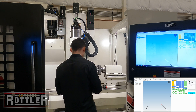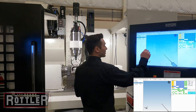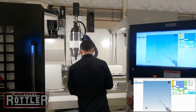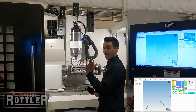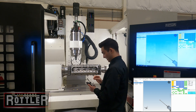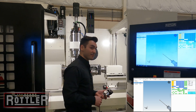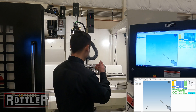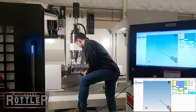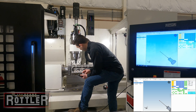Now we want to go and get our middle section, or as we call it, our dividing line. This is a manual operation now, so I need to rotate the A and B axes — A being the fourth axis which the head is sitting on, and B being the fifth axis which is the spindle itself. I can also use the linear commands: X, Y, and Z. Sometimes a mirror is helpful. I'm now just above my first point in the dividing line.